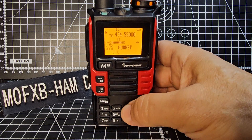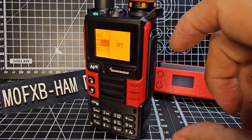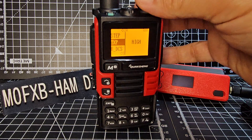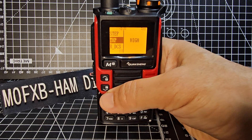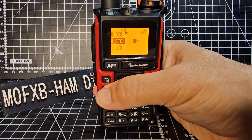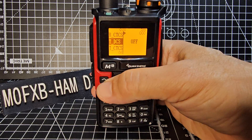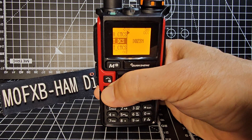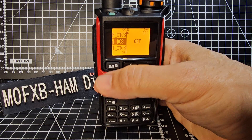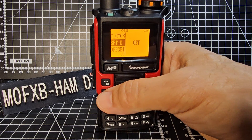Back into VFO mode. If you want to set your tone, go menu. If you want a high number go backwards. Back to one — that's squelch, then step. Transmit CTCSS is there. Menu — actually that's receive, leave that off. Go down one, menu, then down one, menu, and just change it — oh it's DCS, we don't want that. Menu down again — now it's already done.